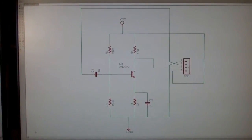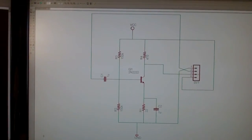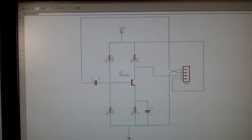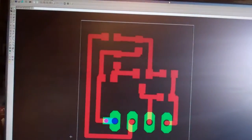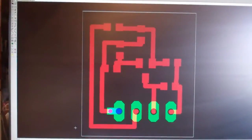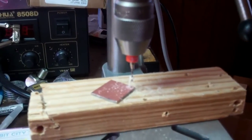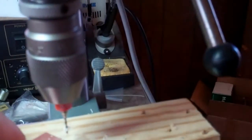This is the schematic of the circuit I built on the breadboard, both in discrete component version as well as the SMD version. It's a fairly simple amplifier — actually it's the first amplifier I've managed to build that works according to my calculations. It's nothing particularly sophisticated, but in case people are curious, this is it. Over here on my other monitor is the board layout, which is what I print out onto the press and peel for applying to the circuit. One step I have to perform whenever I'm building a circuit board is I need to drill a small hole in the corner of my board, because I have to support the board with a little piece of fishing line inside the acid etch.